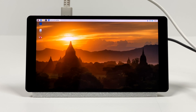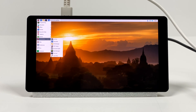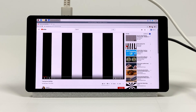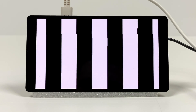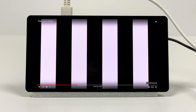I've spent about an hour and a half messing around with this screen. Unfortunately I cannot recommend it if you're going to use it with a Raspberry Pi, and that's really what it's marketed towards. I love the colors, I love the resolution, touch response and accuracy is dead on — but there's one major issue when it's connected to a Raspberry Pi 3 or Raspberry Pi 4 that I cannot correct. I've messed around with the timings and tried about 10 different configurations, but this thing has some of the worst screen tearing I've seen in a mini display. As you can see here with the screen tearing test, this is some of the worst I've ever seen. Everything was looking great for a little handheld build but it's just not going to work out with screen tearing like this.